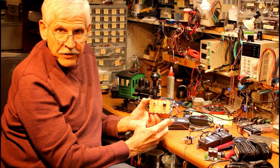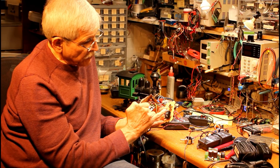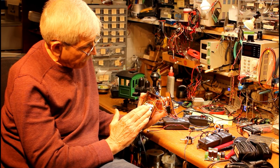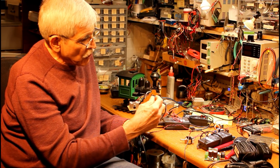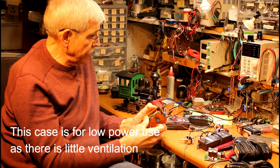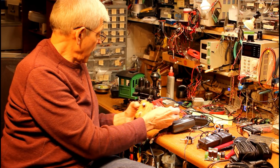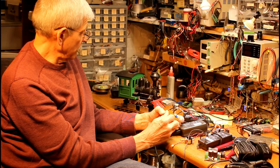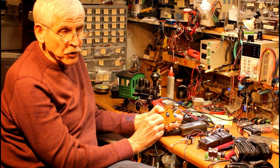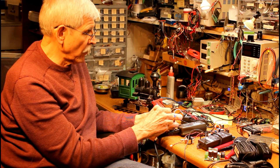Then we need to put it into some sort of enclosure. This is a simple box I made with my laser cutter. Inside there's your double pole double throw switch with the cross wiring on the diagonal terminals, and your power controller — the potentiometer is on three long wires so I can get it up to the top easily. This one is connected to a power supply from an old Compaq laptop. If I turn the knob clockwise — there we go, I've got speed control. It's always a good idea to bring it down to zero before you reverse. Now we're going in the other direction. You can throw the switch while it's running, but it's not good for the motor or the switch — chances are you'll damage the motor first.